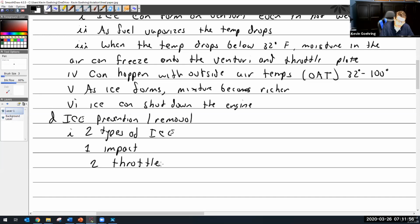The good news is, even though you can't remove that ice, when you open up the carburetor heat, the air source comes from someplace else. So you always have an alternate source of air coming in. In fact, aircraft that don't even need carburetor heat, something with fuel injection, have their own alternate air source. A lot of times it's just a door that's spring loaded on a magnet. If the filter's been plugged up, the suction gets built up, the engine's trying to suck a bunch of air, it can't, so it sucks this door open and you get a bunch of heat. The alternate air door is always inside the nacelle area where the engine is, where the air is already pretty hot. The bad part is, the alternate air and carb heat are in fact unfiltered air.